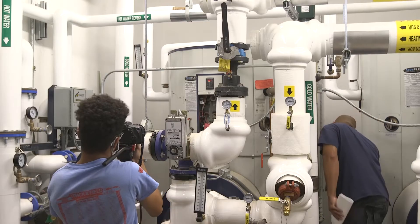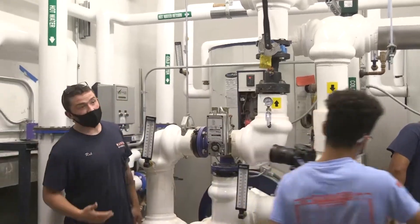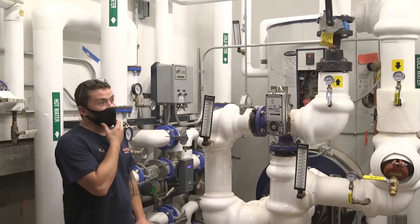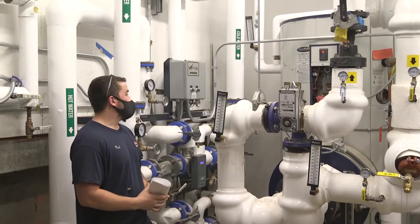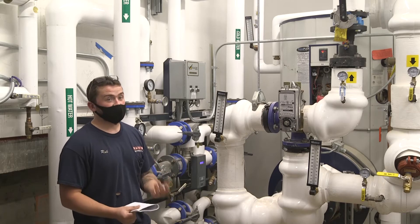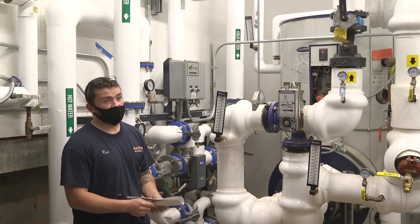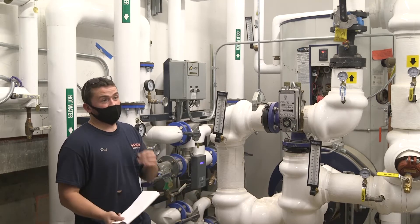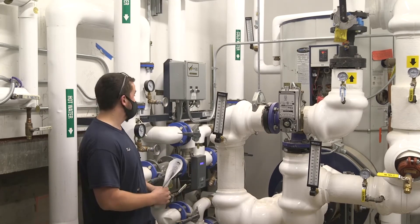The other maintenance procedure is tank flushing. This again depends — some tanks can get very fouled and dirty on the inside, some not at all. It depends on where you are, how much water you're bringing into the tank, and the quality of the water. That would be on an as-needed basis. I would recommend starting at once every six months. If you're doing it every six months and the water is coming out clean, then no problem. If it's coming out very dirty, up it to every three months and adjust your schedule based on what you need.